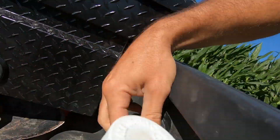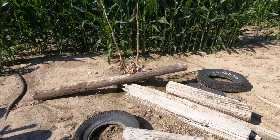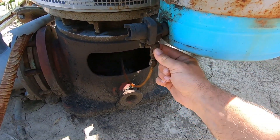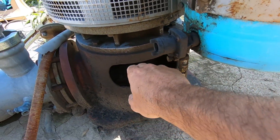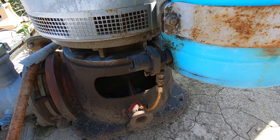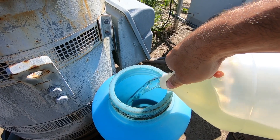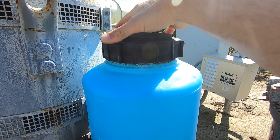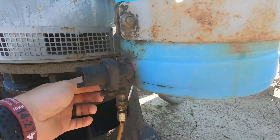Right now I need to make sure the well has adequate drip oil — I've got a little gallon jug here, enough to do a circle. This is how this well is lubricated. I haven't touched this yet this year, so it gets that oily film. This setup here — you fill it up with drip oil, it drips out through here and goes down inside that pump, lubricating it. It drips anywhere from every three to ten seconds, varying throughout the day by temperature — you just want to make sure it's dripping adequately. On these plastic ones I usually leave the lid cracked just a little bit because the vents sometimes don't work well and can actually stop the drip, so I leave them a little loose so air can get in.